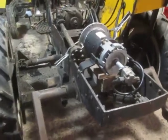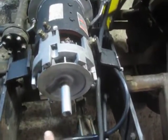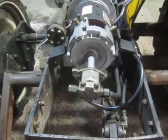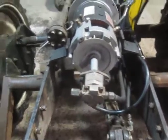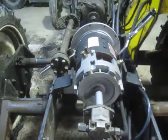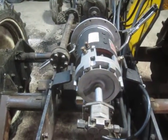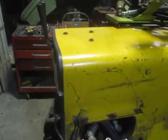My goal is to just reuse the same open-center, constantly-flowing hydraulic system using this little pump that used to be attached to the back end of the Renault engine, mounted onto the tail shaft, so it spins whenever the motor is spinning. If I want to run hydraulics at a stop, I'll just declutch — clutch in and disconnect the wheels from the spinning motor — and I think that'll probably be fine.